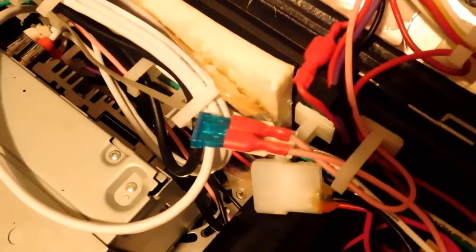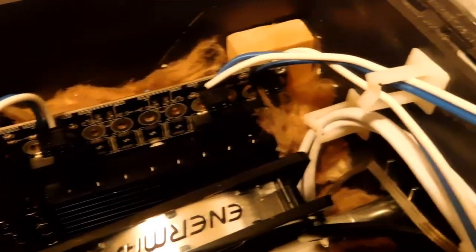You can see one of the 12-volt batteries sitting below the bass port. There's the back of the radio and you can see the RCA jacks. You can kind of see the power supply down there — it's covered by the radio. You can see the fan for it right there, and there's one of the fuses. That fuse is for the fan, and this fuse protects everything coming off the relay. There's the 14-pin relay and the noise suppressor. Following the wires over here, there's the other 9 amp-hour battery. Coming over here, you can see the fan facing our amplifier — there is our 4-channel, 400-watt amplifier.